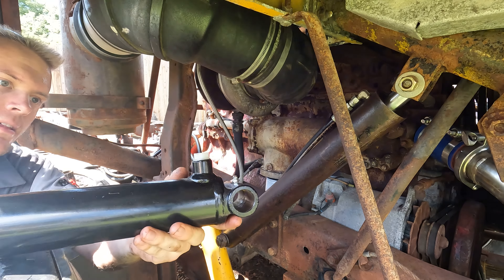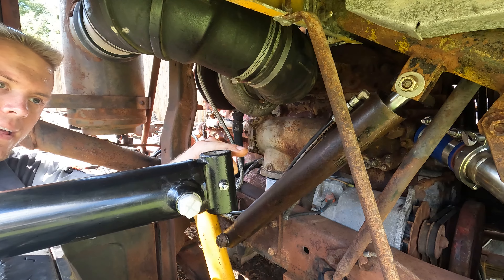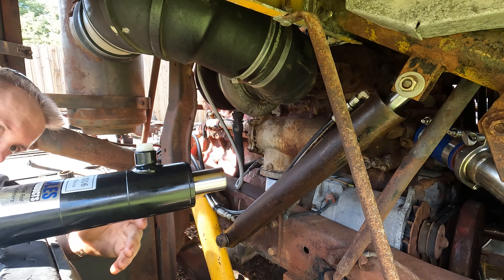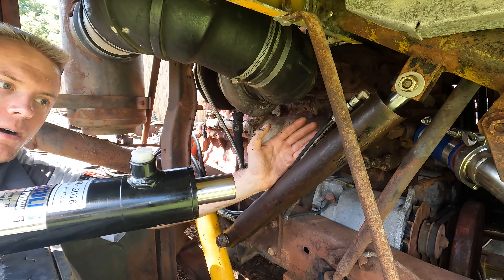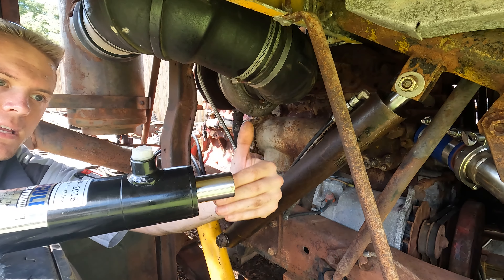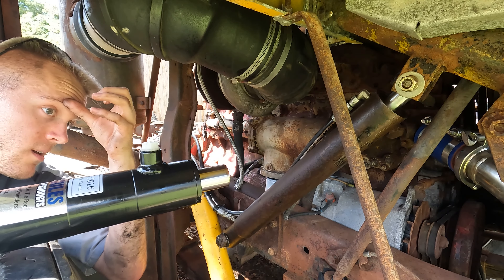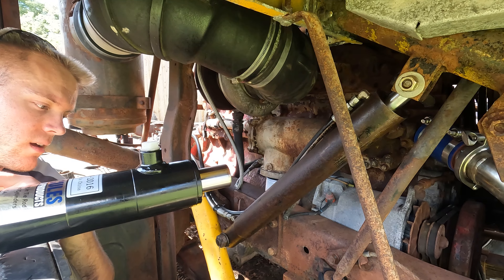A couple of issues. One, this tube is too wide for my base mount on the 68, so I'm going to have to trim about an eighth inch off each side to shrink it down. I may also have to alleviate some space on this flanged bracket. The pin is inch and a quarter diameter and the factory one is one inch, so I also need to shave down an eighth of an inch on each side and then drill my hole through that. I will be losing some stroke — about five sixteenths — off of this sixteen inch stroke, which really is nothing in the grand scheme of things.